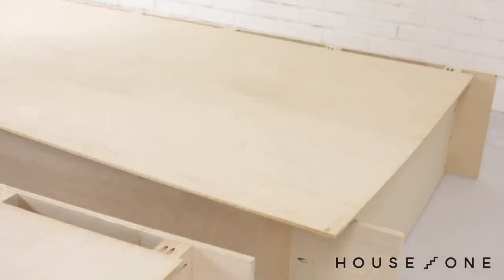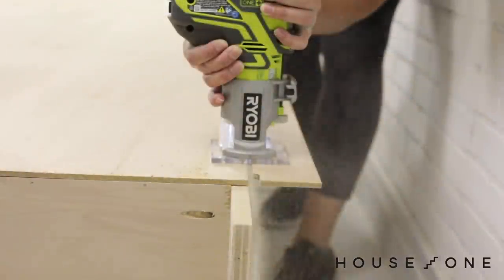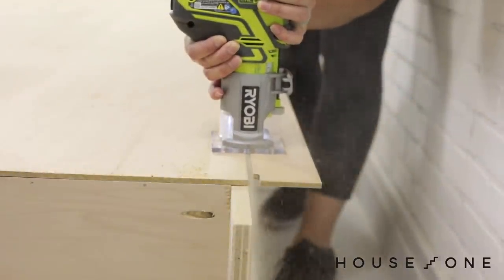For additional support I'll also screw through these boards and into the studs in my wall. That combined with the support of the face frames, which are also on edge, should really help carry the weight through the center of these longer shelves. Next I laid the quarter-inch plywood backs onto the assemblies and trimmed them using a router fitted with a flush cut bit.